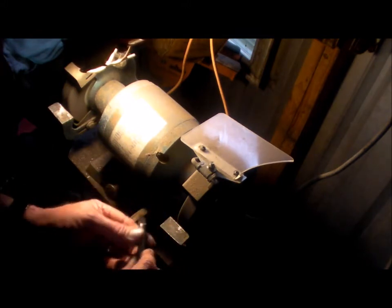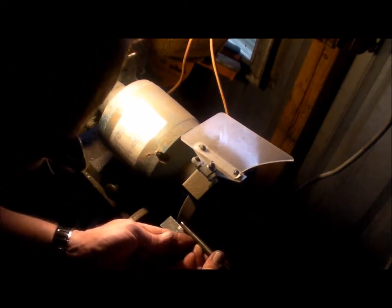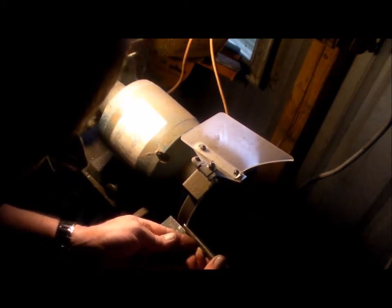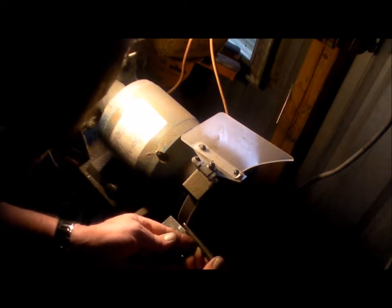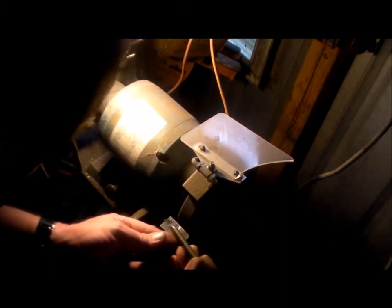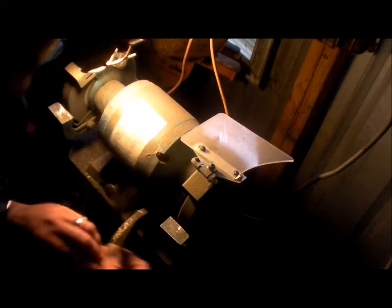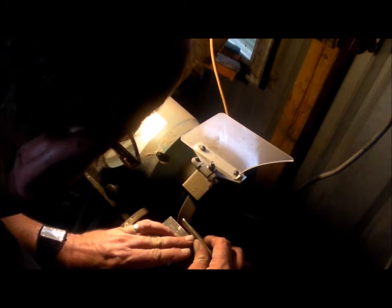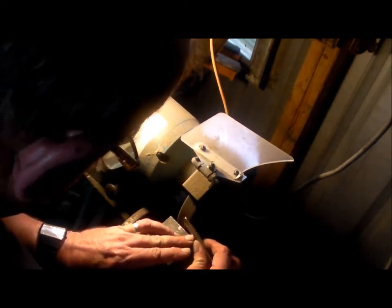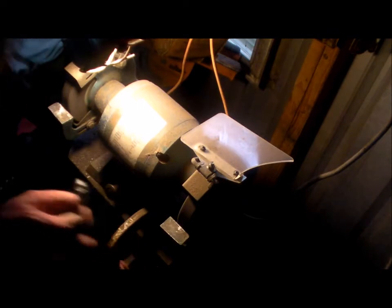This is the cutting edge — just the cutting edge. I hope so because I've already taken it down. I'm just on the fine wheel to get it down to 5mm. I don't have a surface grinder; I'm just using a standard bench grinder.